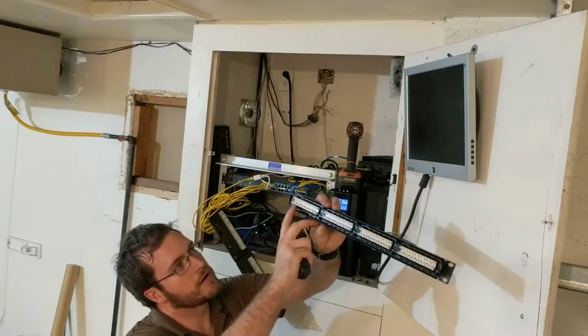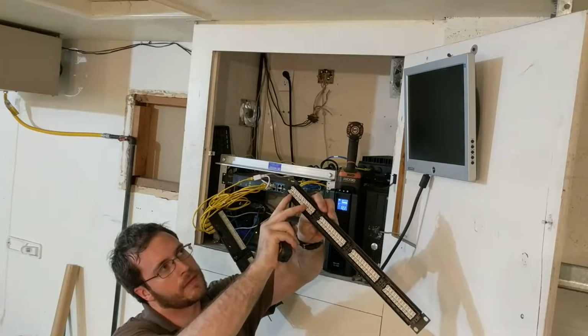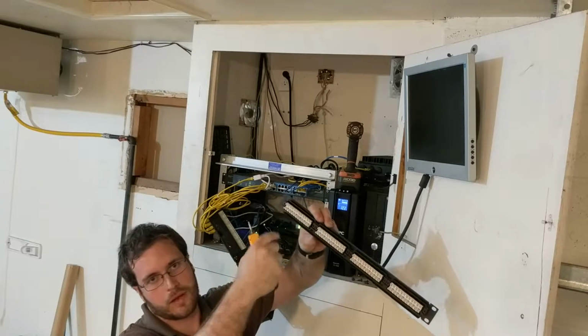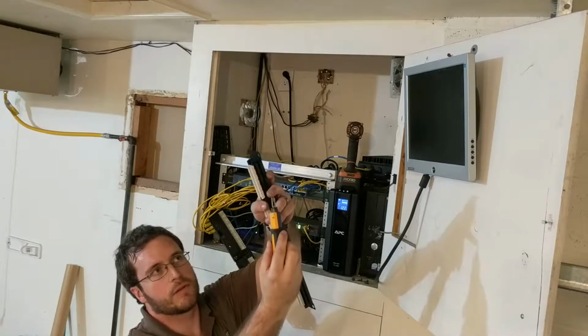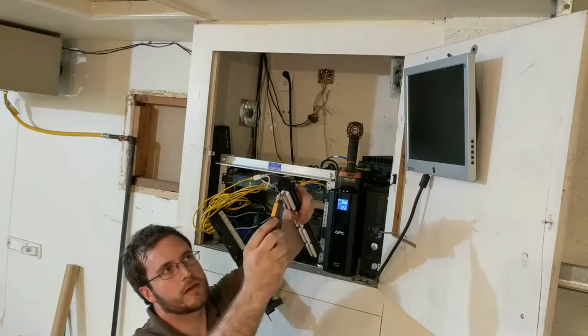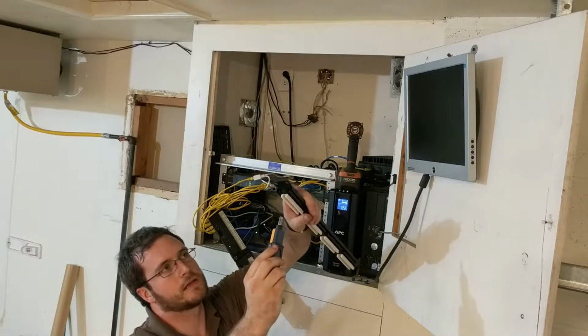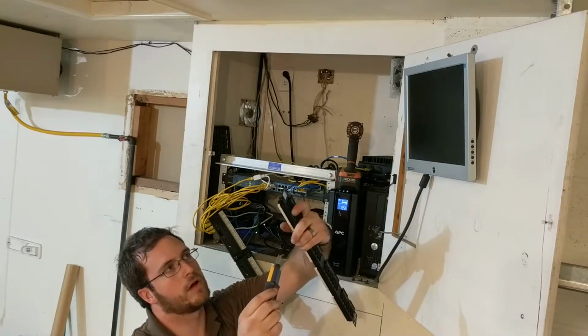basically what I've got here, there's a whole bunch of little teeny slots here that the wires on the network cable get punched into with this guy. Basically, it's got a little bit of a blade right here. Put it on the outside part, push, and you hear the click. That means that it's snapped the wire down into the little claws.